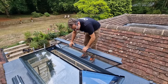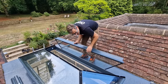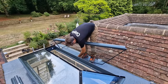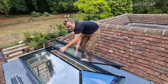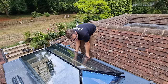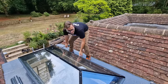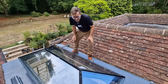For final positioning, you basically want to take the unit, put it up against the ridge, lower it down, and then a section locks into the eaves beam. So I lift it up, carefully place the top against the ridge, keep it nice and true, then lower it down — and it just literally locates itself. Isn't that super, super simple? They're so well engineered and put together. When you've got a product which has been so well thought through, designed, and packaged — making the installation so easy — it's the end of the day, it's started raining, and I'm not panicking.